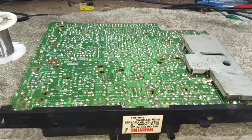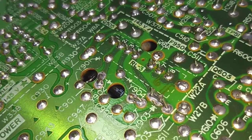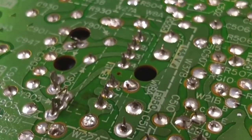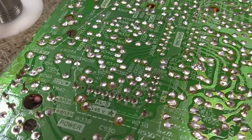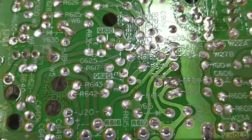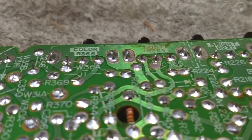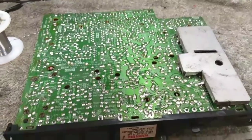Now that we've done the top side, we definitely want to pay attention to the bottom. The points of interest are all of those connectors that you plug the sub-chassis into. They do have little rings around the connectors there that should be paid attention to. Soldering on them doesn't look great, but often when you push the connector back down on it, it breaks free somewhere. Also the power supply — there are sections that will get a little toasty, so you definitely want to make sure that's good. Go up to the front where your controls are and check that your controls are still attached, because sometimes they screw up too. I'm going to do some touch-up work here, finish checking all the capacitors, and then put the thing back in.